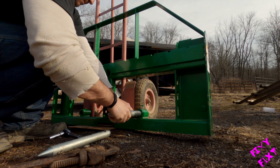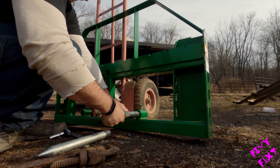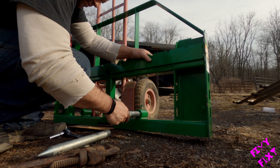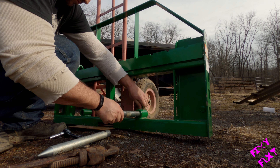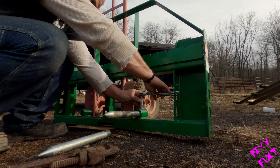I'm specifically doing this by hand right now. I don't want to start turning that bolt in with the ratchet because I don't want to strip out the stabilizer holder that the bolt is threaded into. So I'm just pushing that spike in, turning that bolt down by hand, and once I feel it start to set itself into the stabilizer spike, that's when I'll start turning the wrench on it — but not before that.